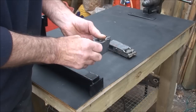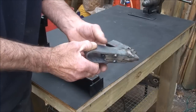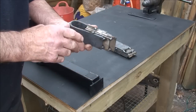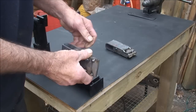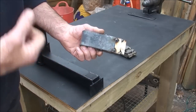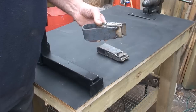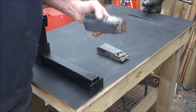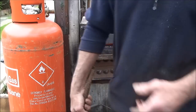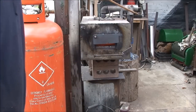And I think I'm probably going to weld a handle on these now as well, because it's easier than trying to grab it with the tongs, because the tongs I've got aren't really suitable for this. I need to get some more tongs, but I'm going to weld a handle on, because I can hold the work steadier with a welded handle anyway. So I'm going to fire the forge up now, and I'm going to beat these to death and shape the axe out of them. So I've welded them bars on there. Let's get these in the forge now.